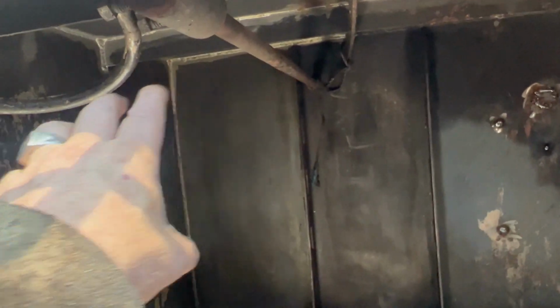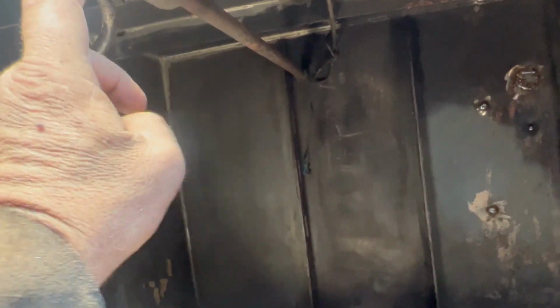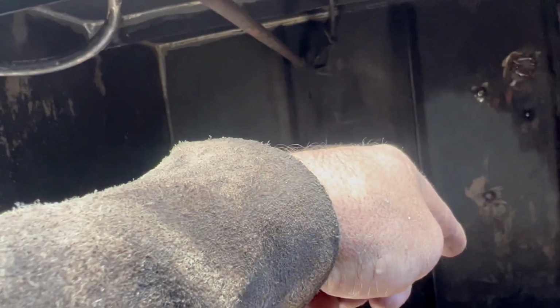I'm going to run an electrical conduit through this corner over here, close to this wall, because all the electrical's coming in this side from the wheelhouse. So I don't want to do it 5 times, 10 times, 20 times, 100 times. Conduit down that side, so I'll drill a pilot hole, then I'll plasma cut a hole. Then we'll have a conduit with T-junctions either side for bilge pumps into that other lazarette. And into the back tank we'll have bilge pump and fresh water pumps. A fresh water pump as well down the back.